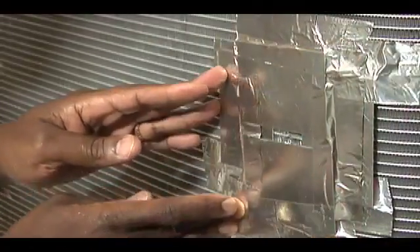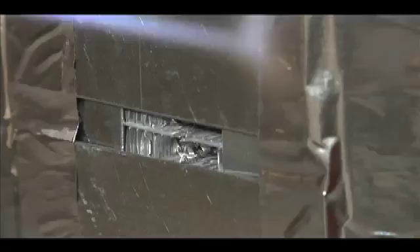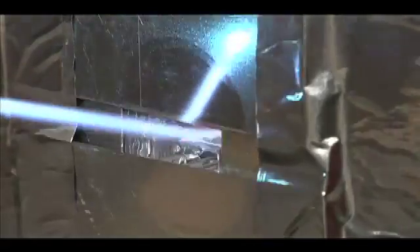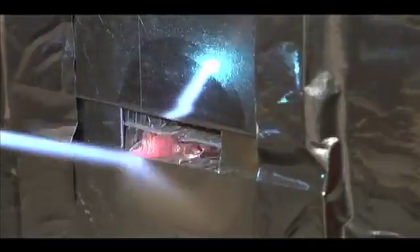This is what it would look like after you're finished. Using a portable oxygen acetylene tank and a number two torch tip, you want to work the flame around the area to ensure that you do not overheat the coil itself, because it will damage. So you just have to keep the flame moving — that's why we suggest using a number two torch tip. Zero in on the area and as it heats up, just keep the flame moving.